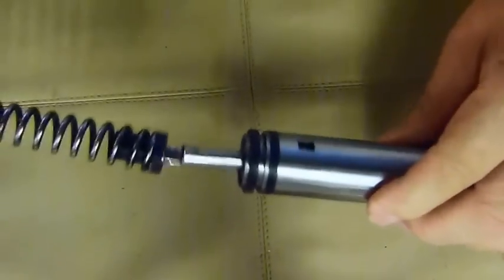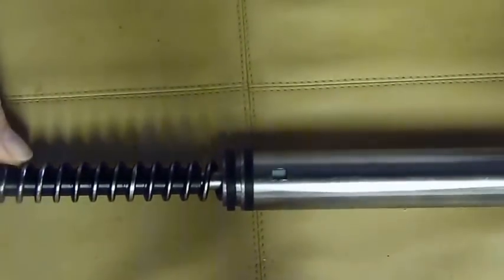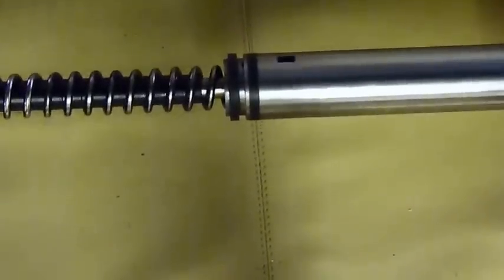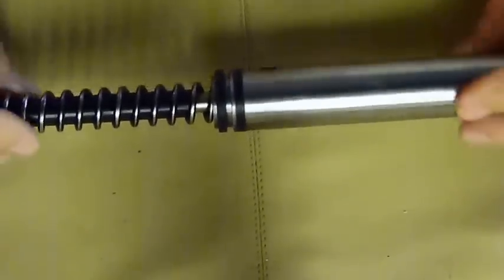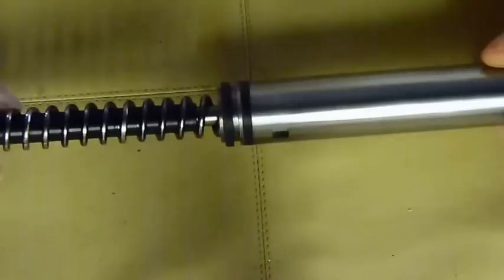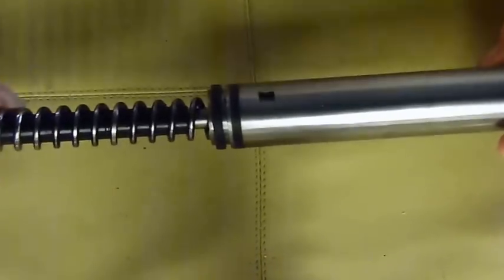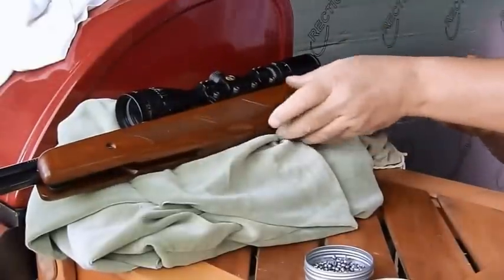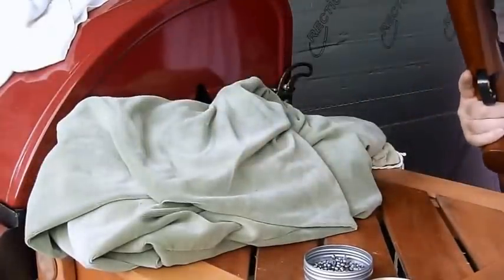So that's actually what goes inside the Paul Short HW97 Stage 3 tune. This one I've taken to bits purely because I'm going to calm it down just a little bit, and then I'll put it back together. I've reassembled the rod.